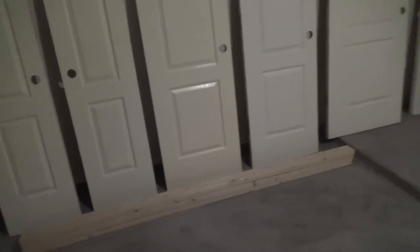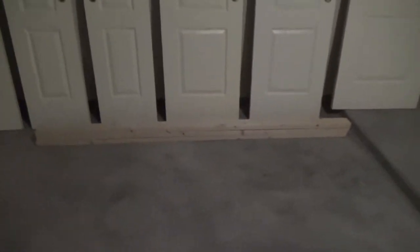I'm going to use a four-inch mini roller to paint these on the flat surface, but not where this groove is — I'm going to have to take a paint brush and brush all that. When I do that, I have to be careful not to build up the edge and have it run. There are a few common sense things you're just going to have to be careful of as you go.